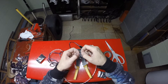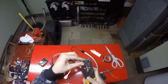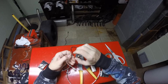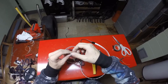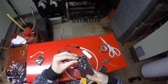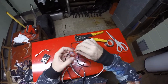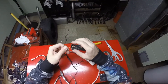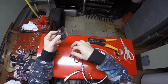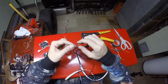Now I'm adding a quick disconnect female to female adapter. This is an optional step, but makes things nice and tidy when you connect the controller to the harness. Here you see me using heat shrink tubing. This is technically optional — you can get away with using electrical tape, but I don't really recommend it as it doesn't look as good.